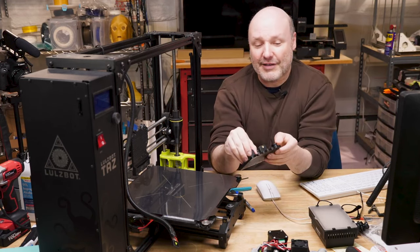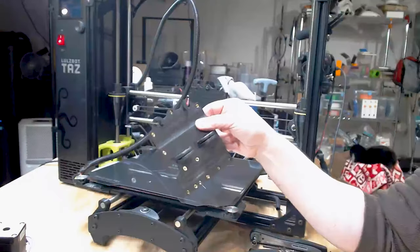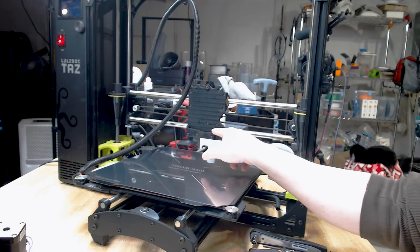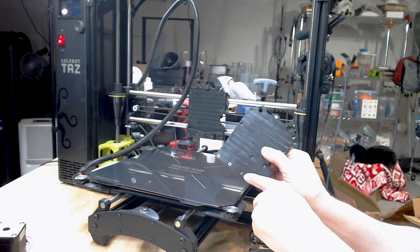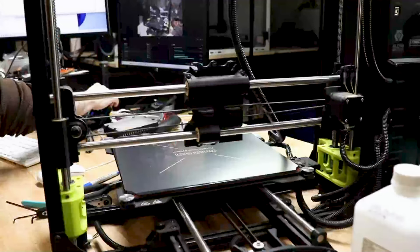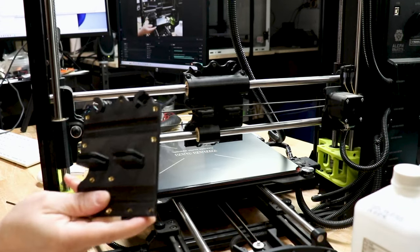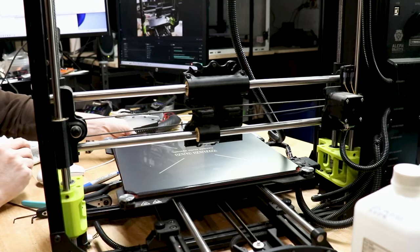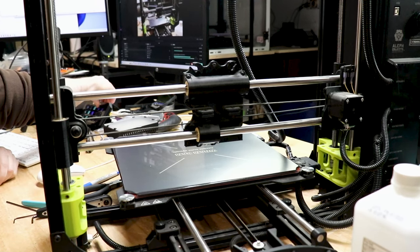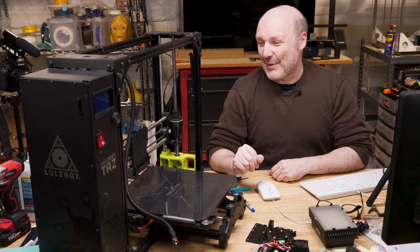So that leaves us with where we are today. I have a new X-axis gantry. This old piece is going to come off, and the new bottom piece is going to go on here. The one thing we have to deal with, which is not a whole lot of fun, is belts. They have their own specific way — a little harmonic tool for getting the belts tight to spec. I don't have that tool, so all I can do is yank and crank. That's phase one.